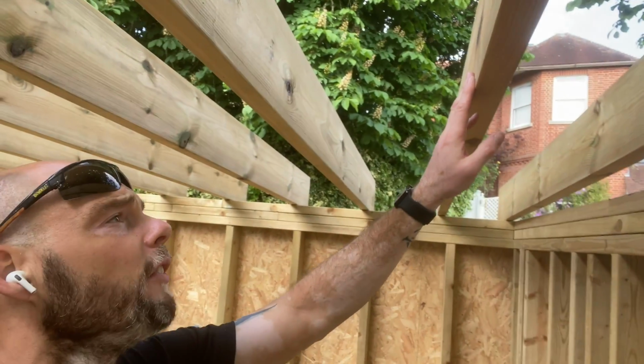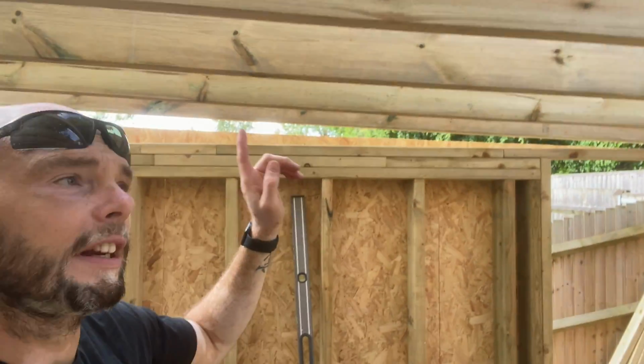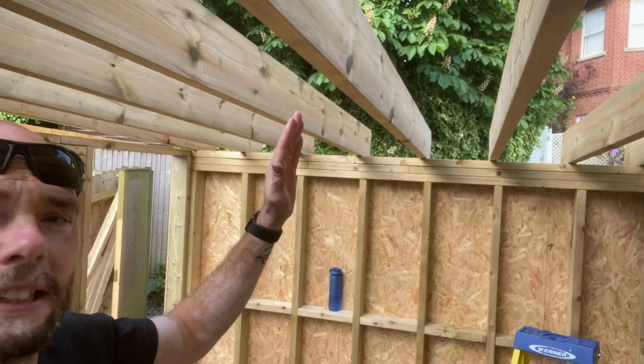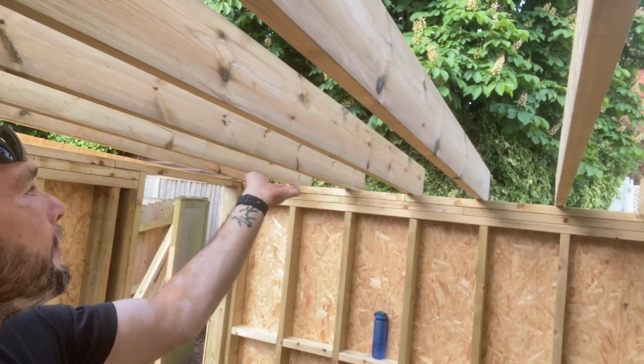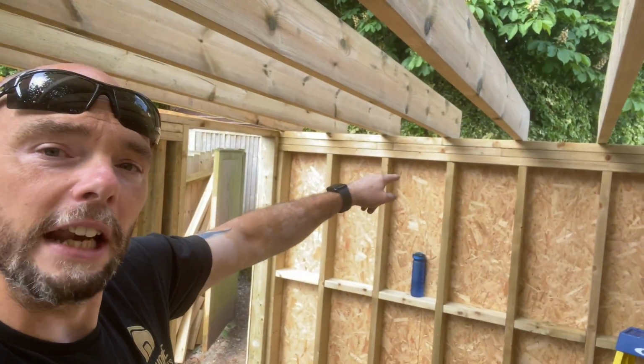They're going to be 35.5 centimetres, so I'm going to go cut those. I'll get those fit first. The reason I'm going to do that before I secure it at the back is where these will be twisted and bits and pieces, before I completely secure it, because it's only got one screw going straight through it, you'll still have lateral movement like that. So when I put these bits in, it'll just allow for that bit of movement. It'll take a bit easier, and then I'll lock it in place when nailing it at the back.